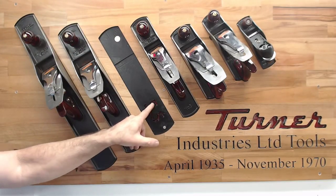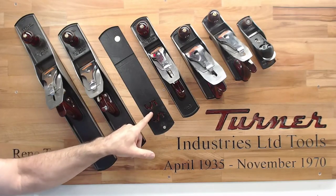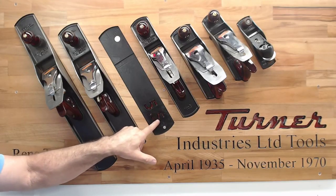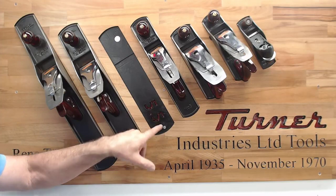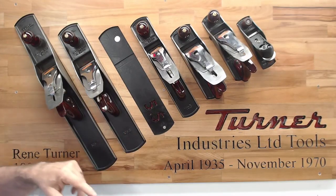And just here, you may not see it because of the light at the moment, but that is 5.5. I've done that with a 3 millimeter end mill in the CNC machine, and then I poured resin into it. Then I dug it out again because it was too deep, and then I coated it again. There's a whole lot of stories in there.